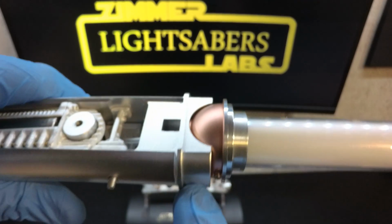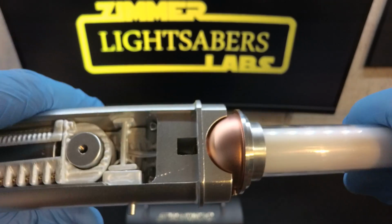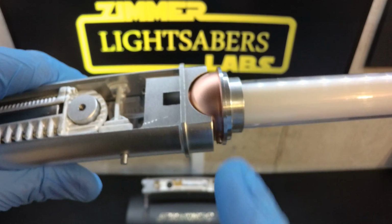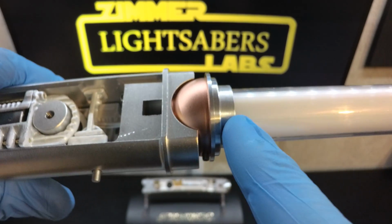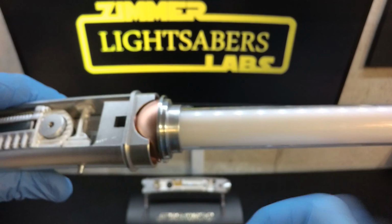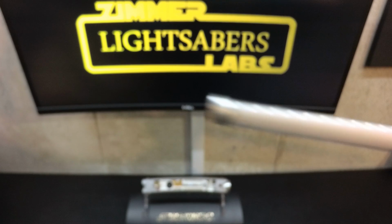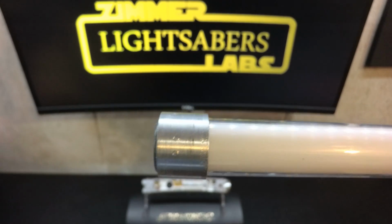Plus, when you screw in the set screw, it's going into the metal, and that makes for an incredibly good lock, whereas if you're putting these in permanently, then you have to drill a hole, and then the set screw goes into the blade, which is not as good of a lock. It's going to damage the blade every time you do it, and eventually it's not going to sit real tight. So this is my method of choice as far as working with this kind of thing goes.